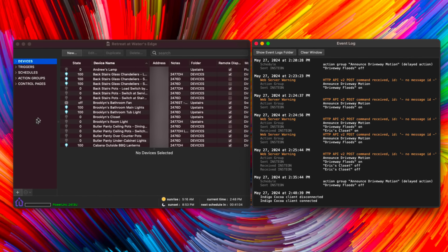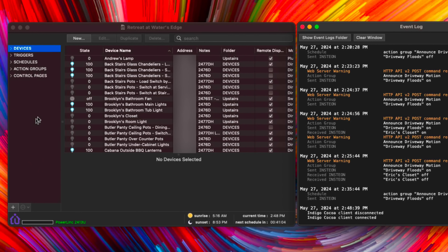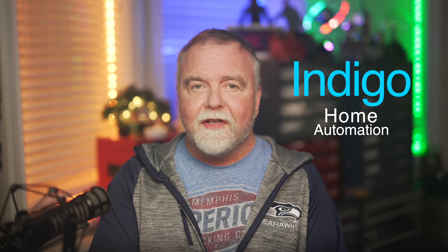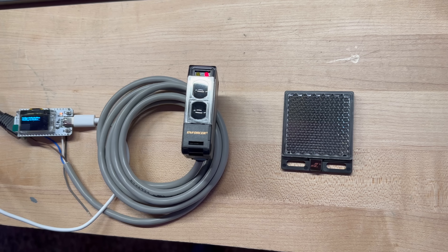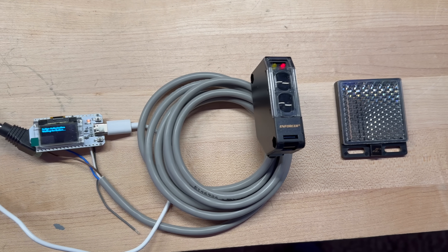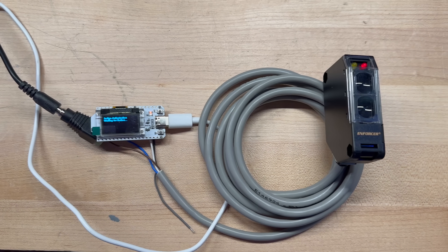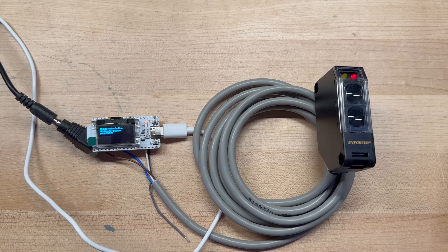Finally, I needed it to integrate into my home automation system. Almost all of my automated devices are Insteon, but I've always run local controller software so it's not on the cloud, and thus I wasn't impacted when Insteon's cloud service went away. The local software I've been running for almost 20 years runs only on the Mac, and it now runs on a dedicated Mac Mini connected to a UPS and the Insteon transceiver. The goal was that when the beam was tripped at the driveway entrance, something would connect over WiFi and send a message to the Indigo software, which would run an event to announce motion in the shop and turn on the driveway spotlights. That something will be a little ESP32 module — a Heltec WiFi Kit 32v3 from Amazon.